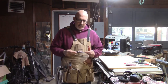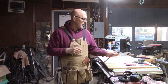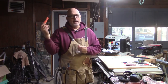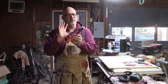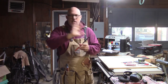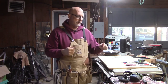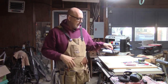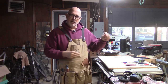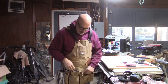This top pocket has just a flat carpenter pencil — I use it to scribble on the face of a board before sanding or planing. Then I keep this push stick. I know a lot of folks have concerns about this style, and I've seen a lot of videos about that, but I'm not getting into that debate. Where I really use this — since I have a push block — is to have it in my left hand to support a board going through my table saw from the left side. That's why I picked it up, and it's great to have right there.